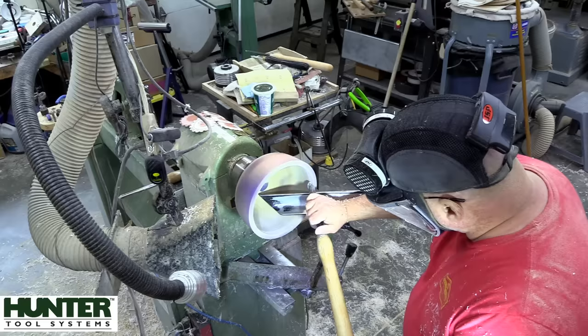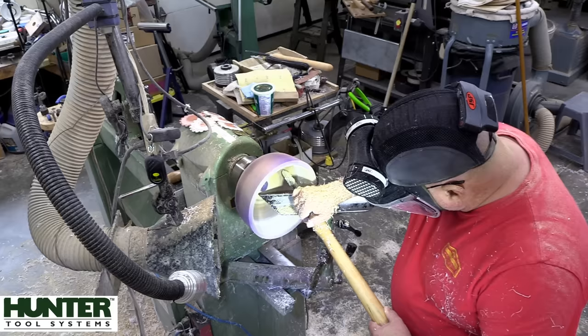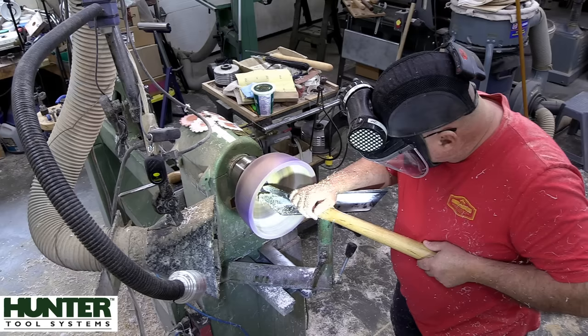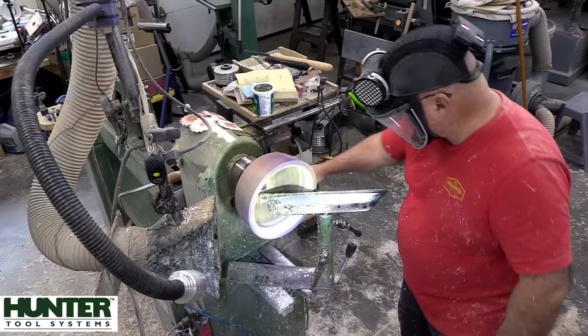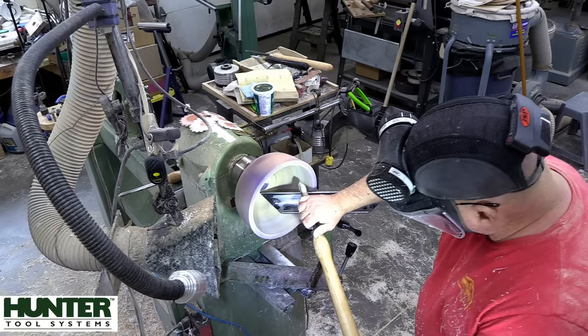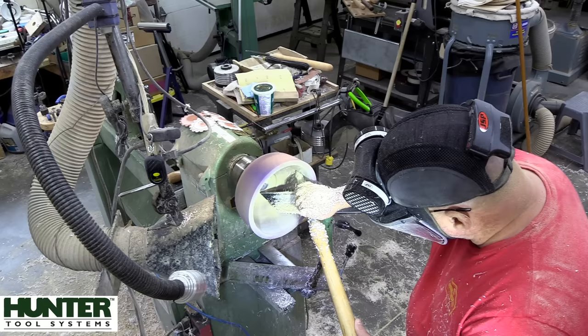In total I think I did around three fillings of the CA glue on this bowl and one with the UV resin. It's just full of cracks further down into the piece - you put the CA glue on there and it looks good, but if you trim away too much of it, sometimes it doesn't get all the way down into the crack so you have to fill it again. Or you turn down past something and expose another crack, which happens more than you may think. At times it can be very frustrating, but in the end the results are certainly worth it.